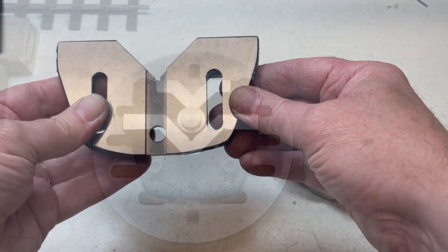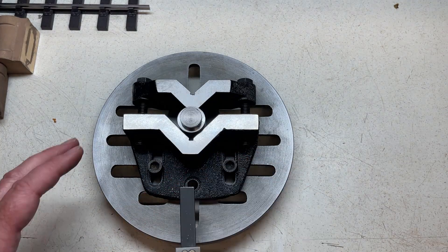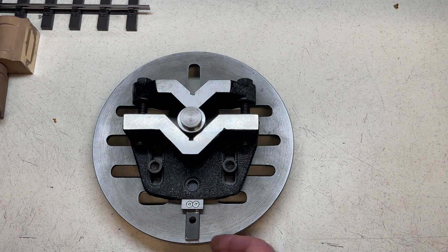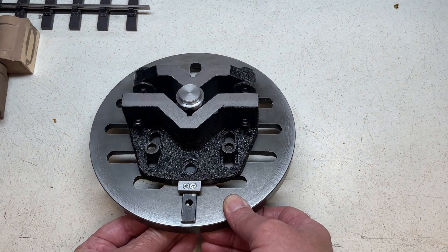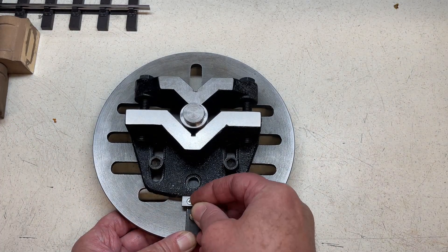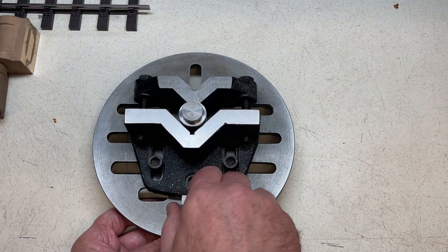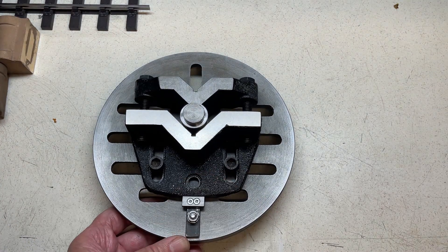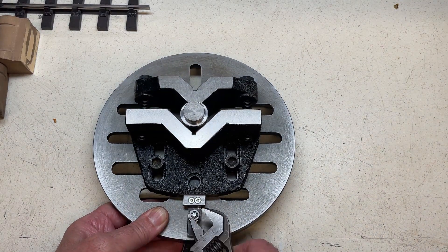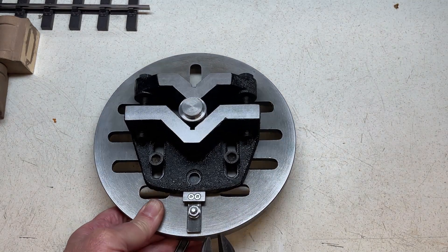So what's the slot for? Here we have an Embryo eccentric sheave waiting for its offset hole. Adding this simple T-bar and bolting it in place securely allows me to accurately reposition the whole of the angle plate with respect to the centre line. The T-bar needs to be fixed securely to make sure there's no movement at all when the angle plate is loosened for repositioning.